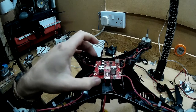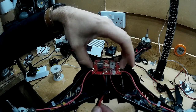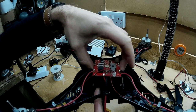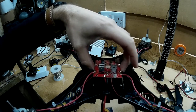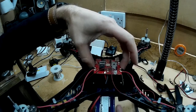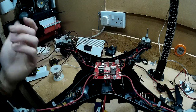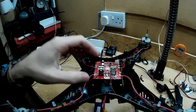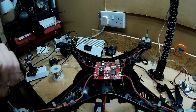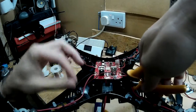Underneath there's a plastic section which holds the board. All I'm going to do is cut the central part out so the battery will be able to slide straight in. I'm not going to actually unsolder everything — I don't think there's really any need to. I should just be able to cut it out with the pliers. Just be careful with the wires that you don't pull any off.